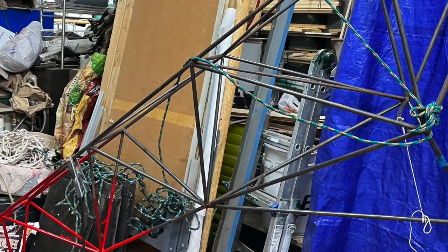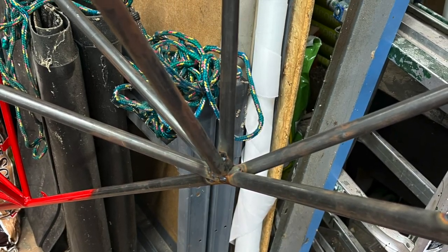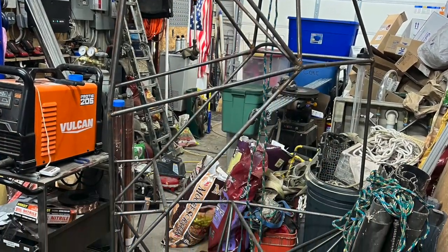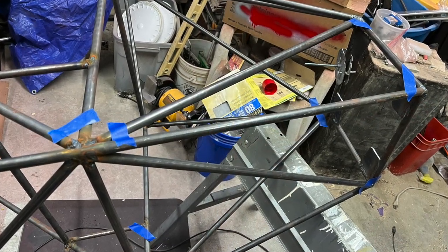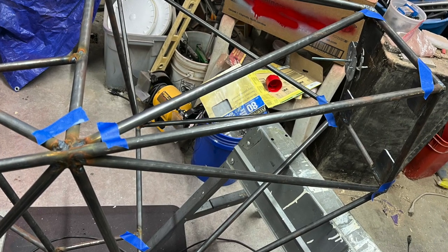I went all the way down the fuselage several times till I found all the missing spots, corrected, and moved on. After I finished a session welding, I'd take a few minutes to examine the welds and clusters, marking any missed spots or areas that need attention with blue painter's tape. The blue tape stood out and helped me not miss anything on the next session.